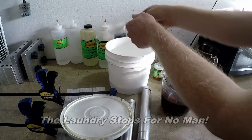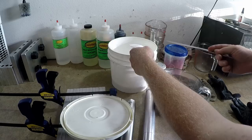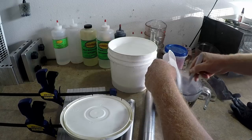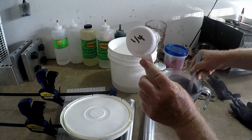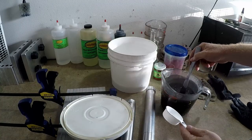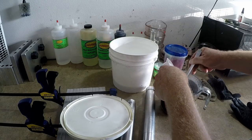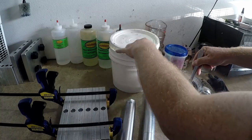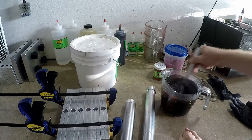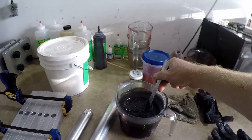So this particular order, the customer wanted the black with red, extra salty. So we are going to salt it as if it were a Cinco, which is 1/4 measuring cup of salt per measuring cup of Plastisol. So I had 2 measuring cups of Plastisol, so I need 2 scoops of salt. And that is, I have found at least, a really good ratio to have. So we're gonna bring the camera on over here a little bit more.